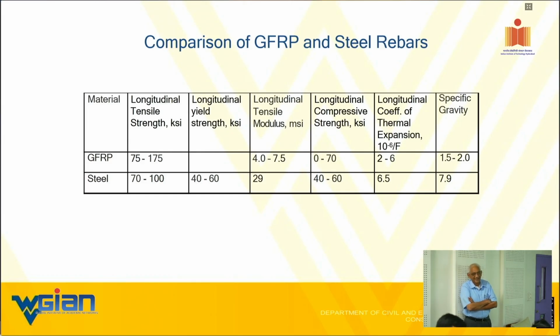Yes. So, again, I'm giving you this now as a designer, not as a theoretician. Do you understand what I said? You simply accept that the strain to failure, I made this statement, I'm going to repeat the statement. In composites, when it comes to the strength related issue, we always say the limit strain, we do not talk about limit stress. We don't. Why? Because the moduli are different in different directions.